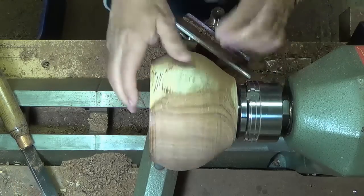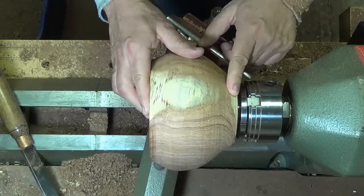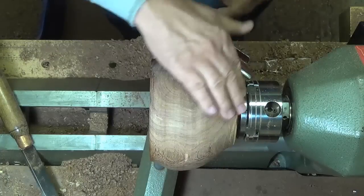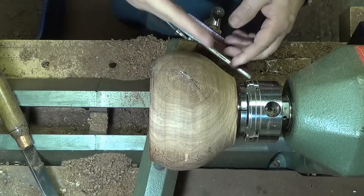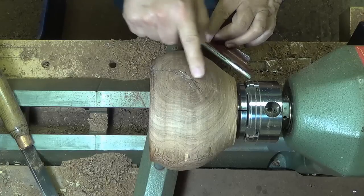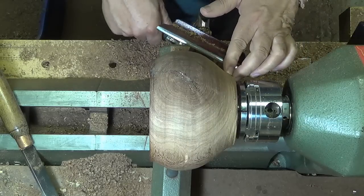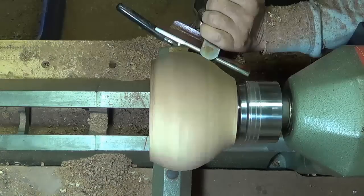Like I'm hitting some soft wood in here and it's really grabbing it. Maybe it's where I was separating the last of the sapwood. Okay. So I got a little bit more of a taper now down in this area because I wanted to taper down that way. I wanted to have a bulge a little bit higher than this yet. This seems a little high to me still. But the diameter down here is pretty good. I'm going to go ahead and start shaping the foot.